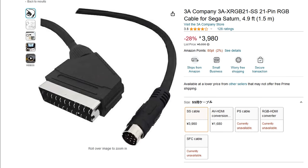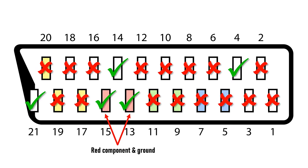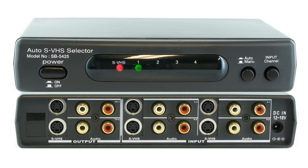Japan and Korea also used the SCART connector, and it's commonly known as RGB21 or JP21. While it used the same connector, some bright spark didn't make it pin compatible with the SCART standard. One of the few pins that matched with SCART was the red RGB pin, so one way of spotting a SCART/RGB21 mismatch is red component video. It was also expanded to support S-Video in the 1990s, but RGB21 never caught on like it did in Europe.